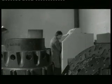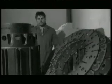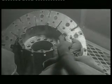For many years, aircraft brake cleaning has consisted of putting the torque tubes and stator rings into a blast cabinet and manually firing media to remove dust, paint and contaminants. This can be a dirty, labour-intensive task. For example, to clean a brake set, torque tube and stator rings from a 737 aircraft can take up to 1 hour, and this can be an expensive labour cost for a business and adds time to the turnaround of the components before they are back in service.